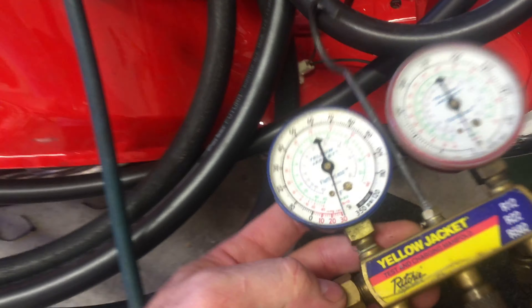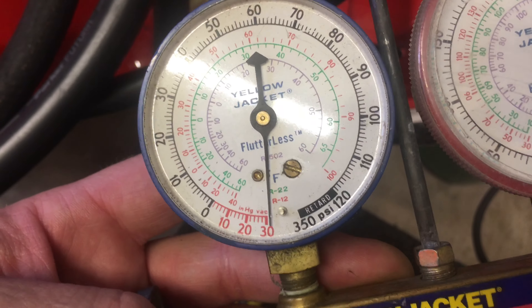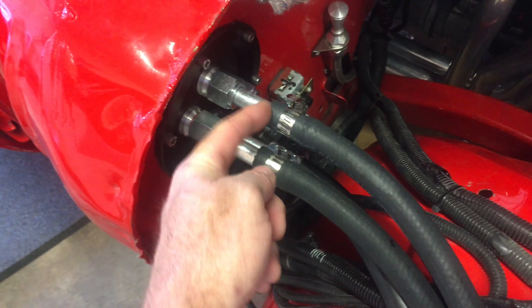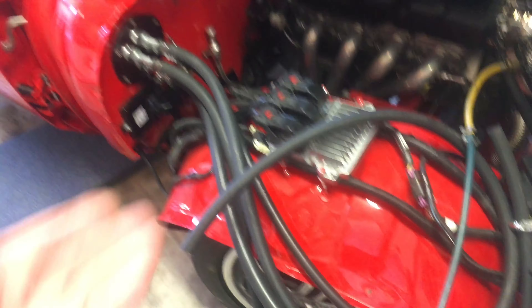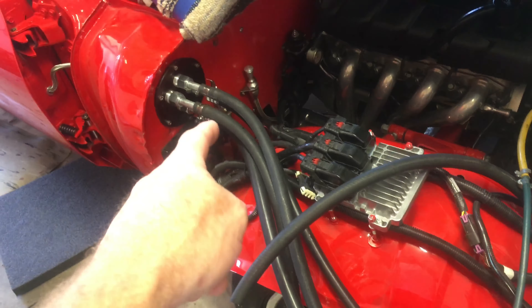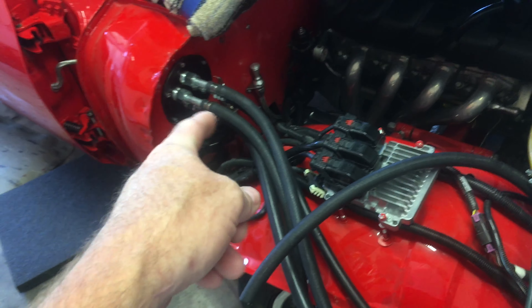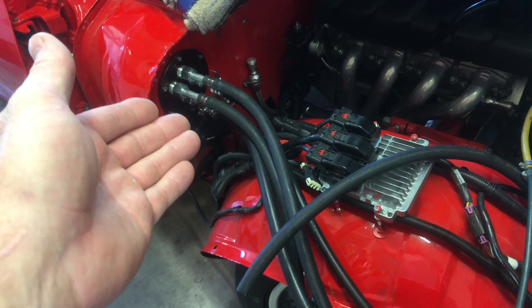So I am going to do a triple vac, and as you see I am down to 30 microns. There is my nitrogen right there. I did like a dummy — I could have had this already done, but my two heater hoses right here, I had one under here and I was like, why the hell do I have a vacuum leak? And that's what it was. Luckily I switched things up because one of those little rubber O-rings was bad — I did rip it because I got it down too tight. But that is fixed, that is ready to go.